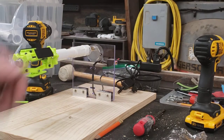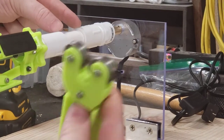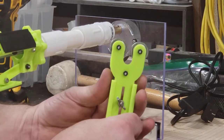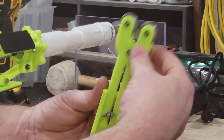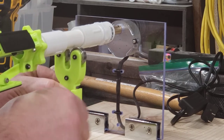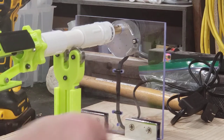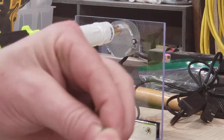If you look at this PVC, there is a piece on it. You want the bearings to be centered with this piece of PVC. These roller stands are height adjustable — unscrew the wing nut and it slides up and down, so you can use this for other setups too. Put it in the center and raise it up just a little bit, tighten your wing nut, and mark the center of the pipe with a pencil. Also mark on the edge of the roller stand.